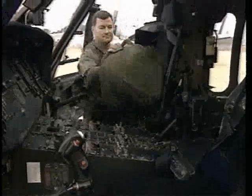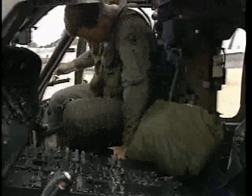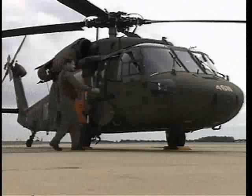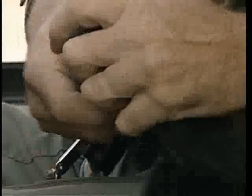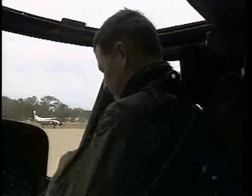Due to the advanced technology of the Blackhawk, there will always be 2 pilots in the cockpit. Normal access to the pilot's compartment is through the cockpit doors. Turn the handle downward to open. Seat belts in the cockpit are a 5-point single-release system. The common attachment buckle has a single-point release. To release the belts and harness, pull the small lanyard. The inertial reel release lever is mounted on the left side of each seat.